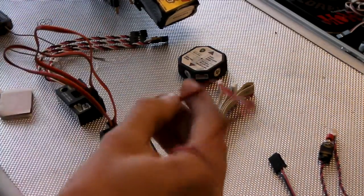Now you see the 3DX450B we're fitting it to. I have the receiver here, and I've obviously mounted that for the ESC, which is to set it up. We have our gyro here, which I've pre-set up and pre-plugged into the receiver. Now, the channels we're going to be using: channel 1 is the Aileron channel, channel 2 is the Elevator, and channel 6 is the pitch. The pitch is the right channel, the Aileron is the left channel, and the Elevator is the front channel. So you can't go wrong.